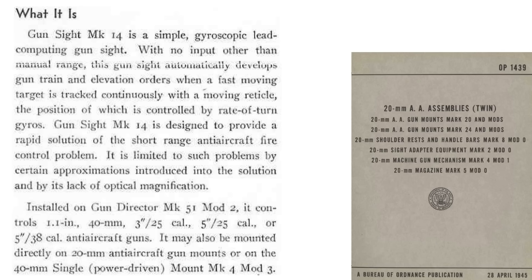This page from an April 1945 Navy 20mm gun document describes the gun sight. It is a simple-to-use gyroscopic computing gun sight. The only input the gun teams need to account for is the plane's range. It provides a quick firing solution, which is needed for stopping low, fast-flying aircraft. The computer makes some assumptions in the firing solution and ignores some factors which have a small influence on the projectile's trajectory. It does not have optical magnification, but working with the Mark 51 director, it can be used with larger caliber anti-aircraft weapon systems.